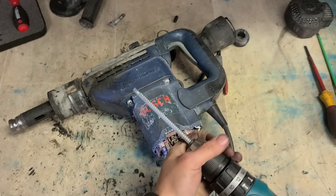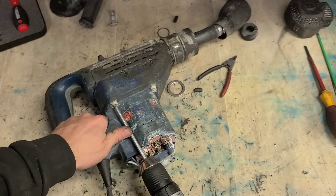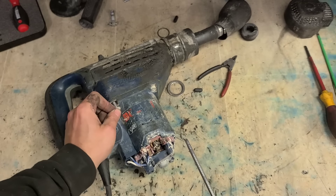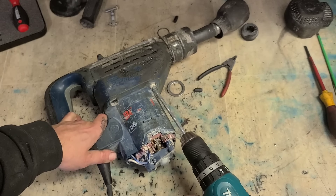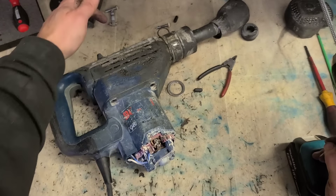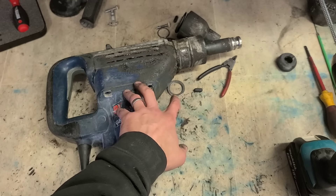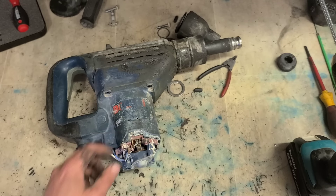Now you may think there's only a bit of dirt, wipe it off, keep going. But obviously if the oil is coming out, there's no oil up in here — it's not going to keep hammering for very long. You're just going to end up costing yourself more money because you then have to put a full service on it. Plus the simple fact that even if you fixed the oil leak and left this, you can't really take this machine into somebody's house or building site — it's going to make a mess. That grease is going to heat up whenever the machine is running, dripping over the floor, going everywhere. It needs to be gotten rid of.